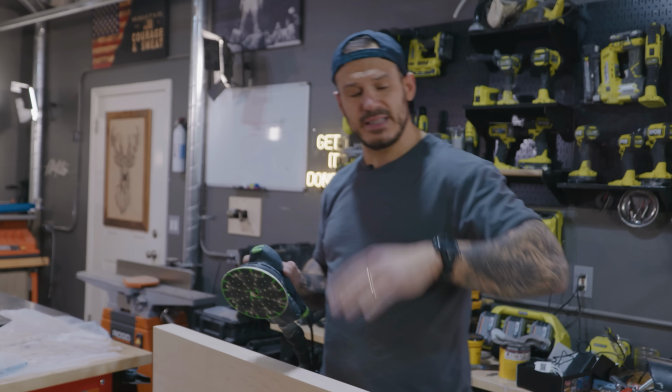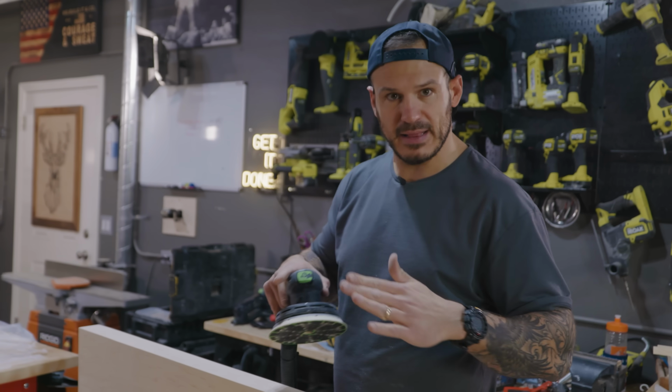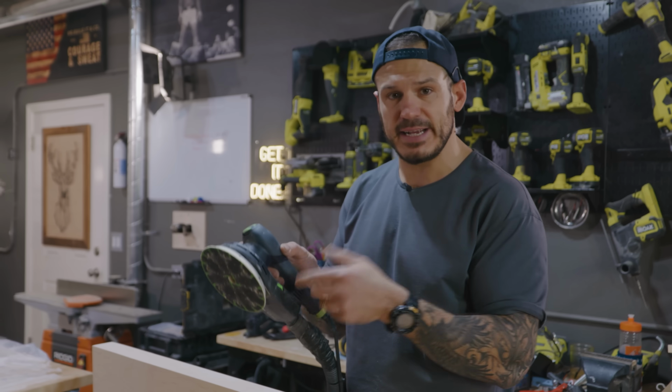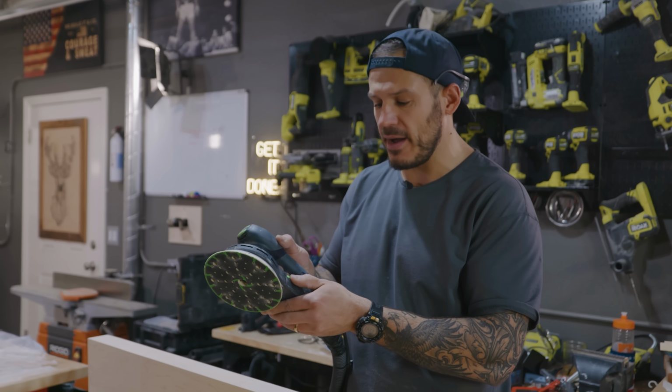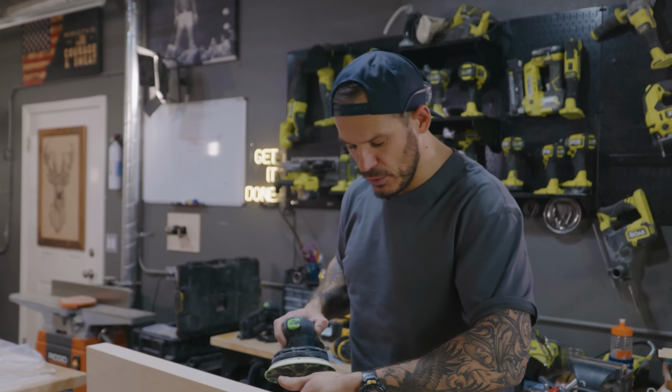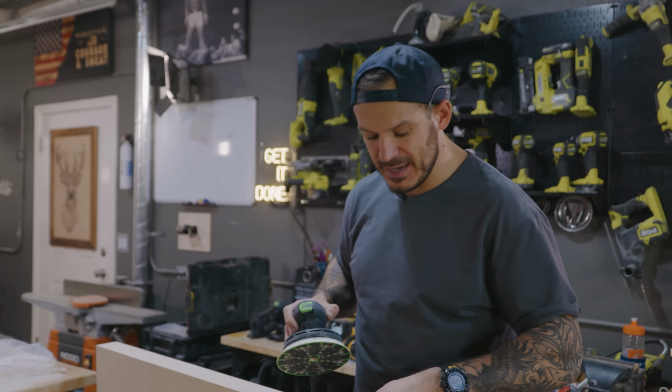Two things I'll mention about sanding plywood, especially when it's edge banded like that or mitered on the corners. Decrease your oscillating speed on your sander from 6, or whatever the maximum number is, to about half. I put mine at about 3 or 4. It really keeps you from taking a lot of the veneer off the edges.